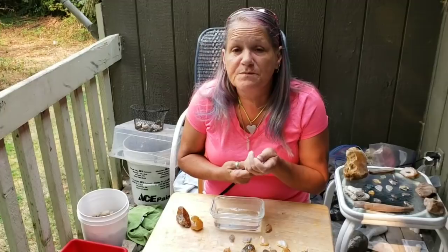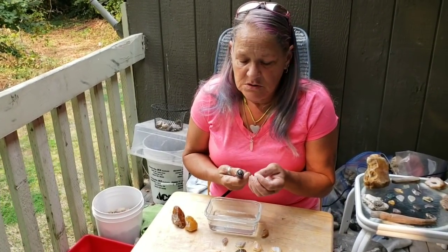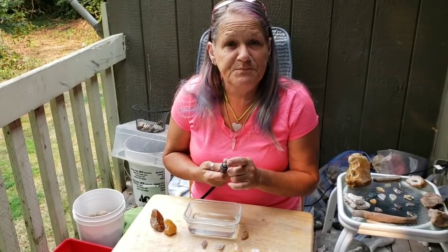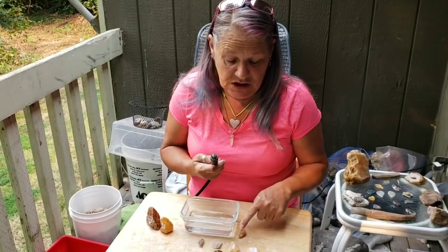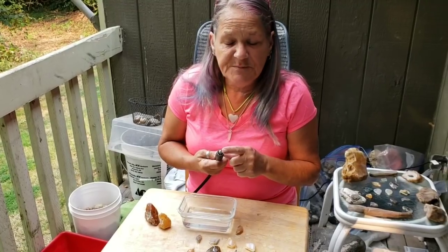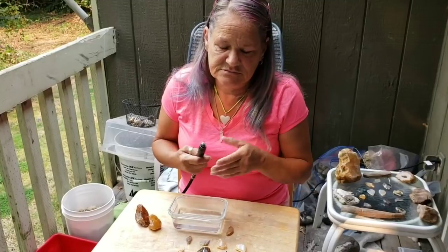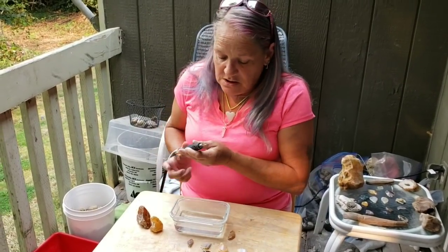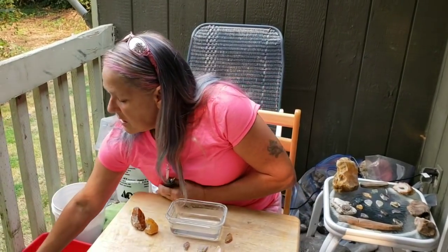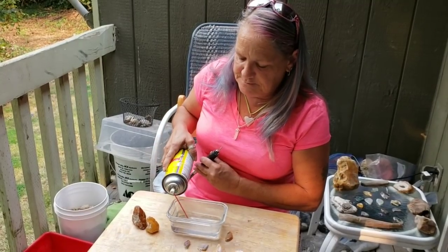You want to keep your drill bit cool, because if you don't, well, the steel gets heated up and those little beautiful pieces of diamond, which cut the rock, metal will not cut rock, those little pieces of diamond go bye-bye. They leave the steel. Anyway, so now that we've got our water mixed up, let me mix it up a little bit. There we go.